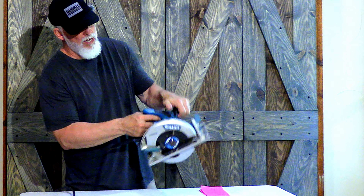Say this is some plywood and I'm trying to cut it. I'm going to take the saw, set it on there, raise it, and move the little guard up with the other green handle here. I get my blade just past the material right there, and then I lock the plate back down. So now it's going to be set at the right depth to cut through the material and no more. I have used saws where the trays are really hard to move and you fight them — this one is pretty simple.